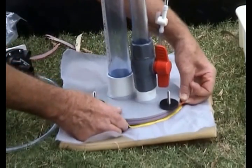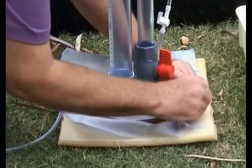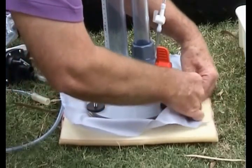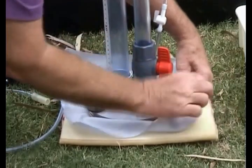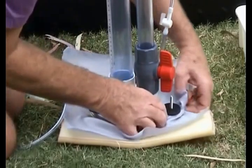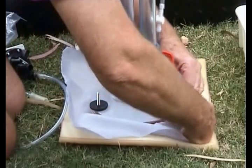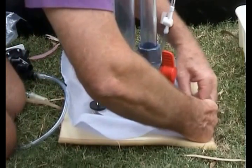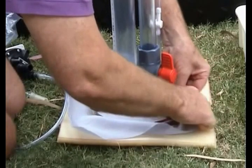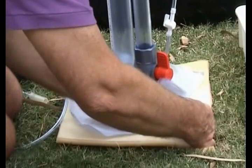Place the permeameter on the pad and pull through some of the cloth — start at the corners, it works well, and then work your way around by lifting the rubber band and pulling the cloth through. Fortunately, you don't have to do this very often; the cloth should last for quite a few tests — it'll last forever unless you damage it.